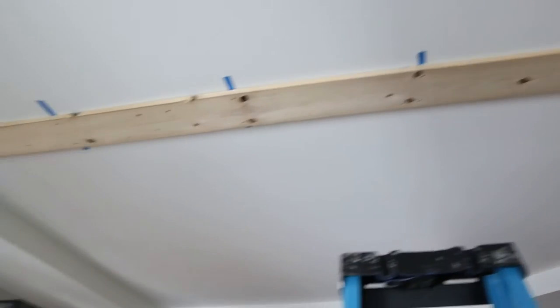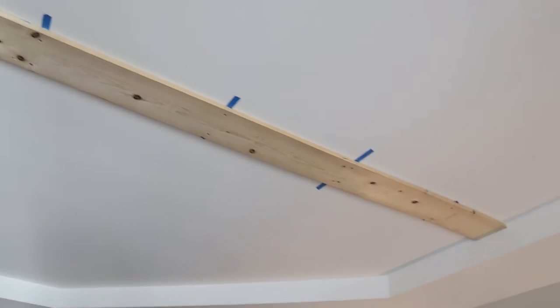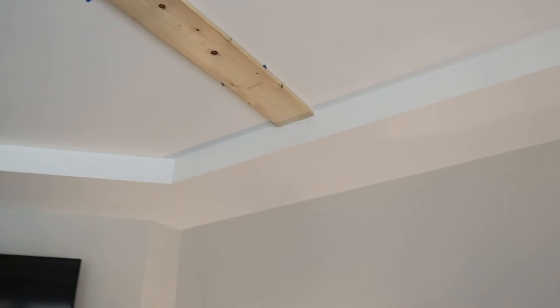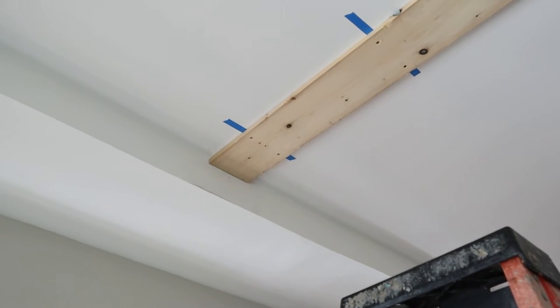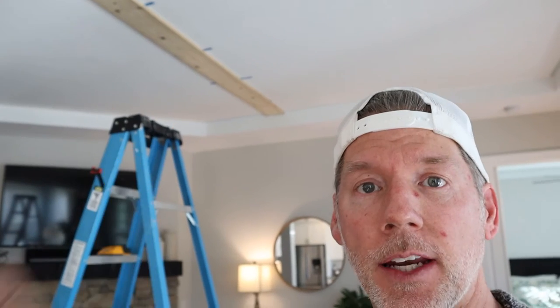I was trying to figure out a way — I had a dead man right there and was going to lift that up and try to use it to hold our 1x8 in place. It just would not work and I was afraid I was going to crash something. So I ended up just putting a support block that you saw — I could rest it on there, clamped it down, and that held it in place so I could finally get over here and screw into my first stud. After I had that done, the rest was easy. So I'm going to put up one board right now, make the beam, stain and all that, and then just attach it to this little support bracket here.